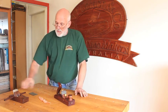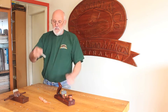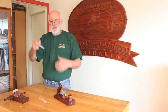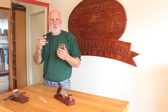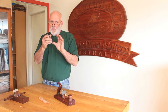We have an expectation of all our bench planes that the lower wear bevel doesn't interfere with planing a large flat surface until the blade is almost blunt. As you saw from the carbide cutouts, all blades are affected by this.